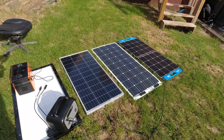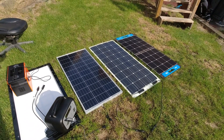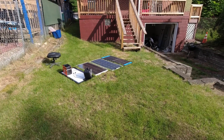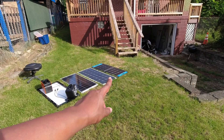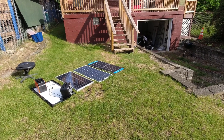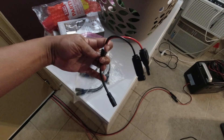What I'm gonna do is wait until it gets a little brighter. The sun is a little more pronounced — this is kind of what you could expect in early morning sun. It's about 8:30 my time and these are the current sun conditions — not super bright outside, but the sun is shining and they're both giving you about 35 watts. I cannot test the X-Star because it defaults to 8mm and I can't do anything with that, although it does have an 8mm to MC4 adapter. I'm gonna wait until the sun is a little brighter to resume testing.